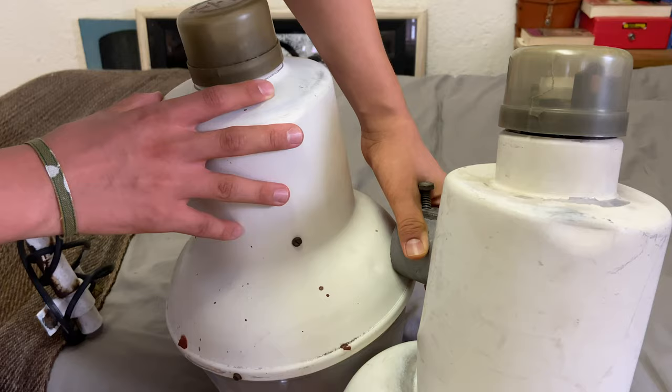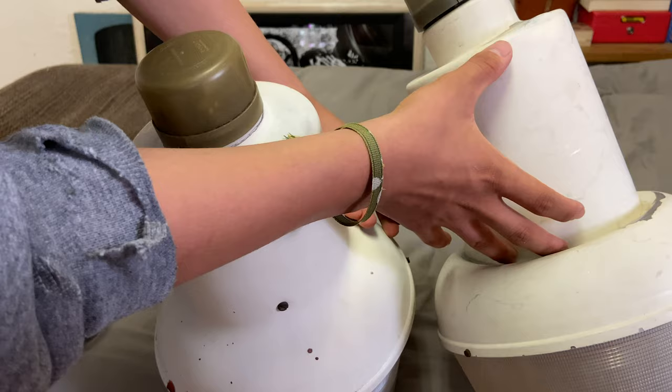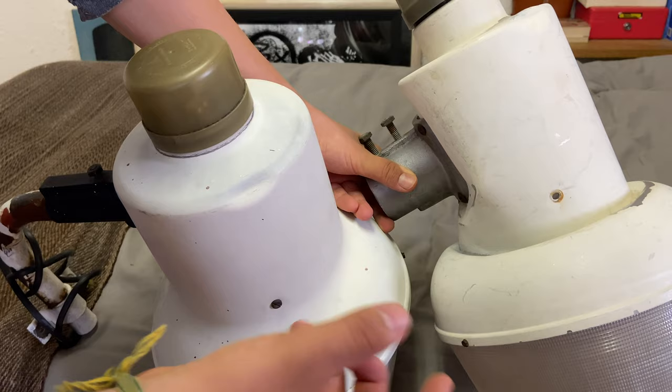they both have a standard twist and lock photocell. They are both made out of metal, and the only noticeable big difference between the two is that the ballast section is bigger in the Mercury or HID version than in the fluorescent version. That's for an obvious reason: fluorescent chokes for PL bulbs are this size, and this one instead had to fit a huge 175 mercury ballast in it.